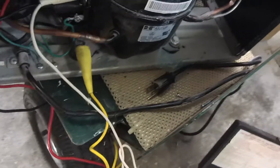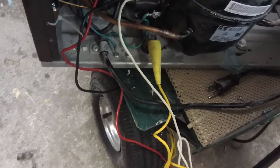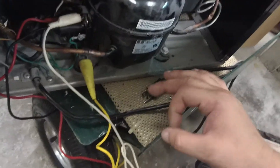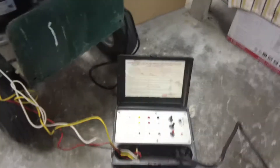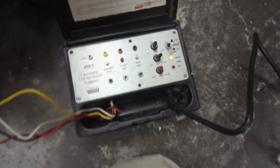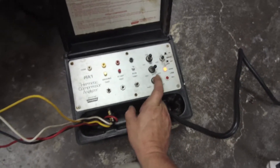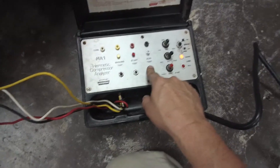It's probably going a little slower than usual. These don't really start off a capacitor — they start off a little bi-metal disc. When the bi-metal disc gets hot enough, it just clicks over and stays running because that's all it needs. It's not a real big issue.